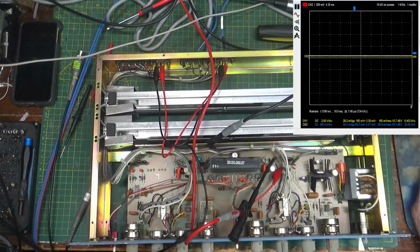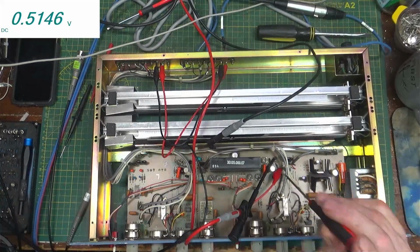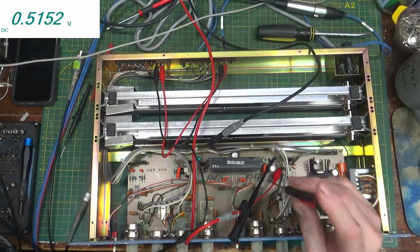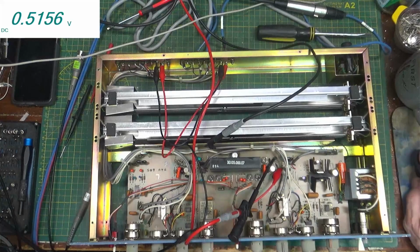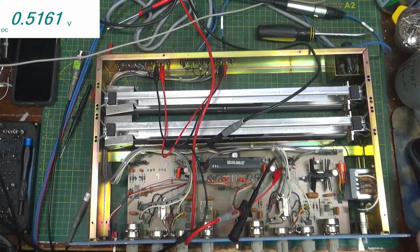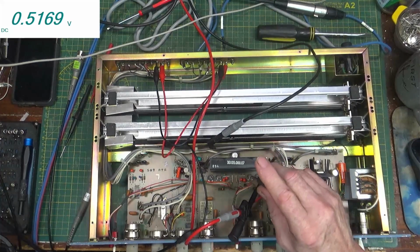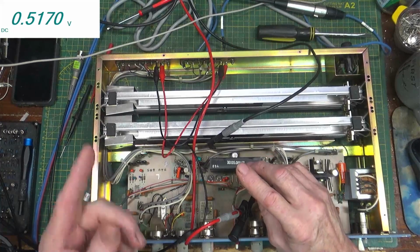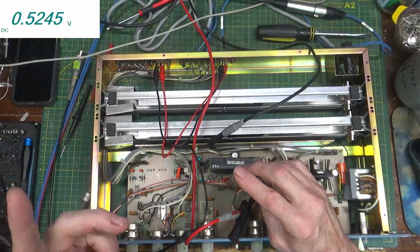If we look at the meter up here in the corner, also what it says is, you have to read it carefully and look at it when you're doing it. What it says is with no input, take this down to 0. Okay, with no input, with this thing down and everybody off on the front, you adjust this R181 here, not until it goes negative, but to the point where it looks like it's going to go negative.